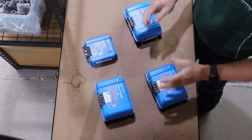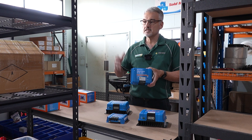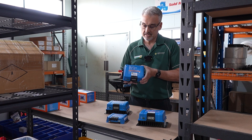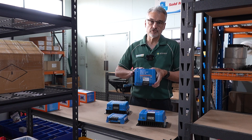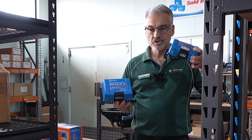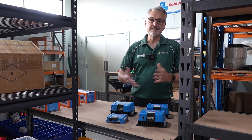The other one is what we call a DC-DC charger. As the name suggests, it is a battery charger. It is designed to take power from your start battery and convert it to charge an auxiliary battery that you're running in your boat, motorhome, or camper van. It's the same as any other battery charger except for where it gets its power source from. So the main difference is: charge your battery versus convert your DC voltage to run an appliance.